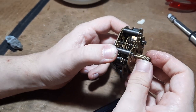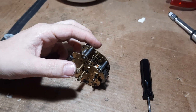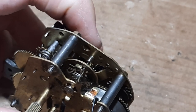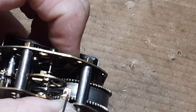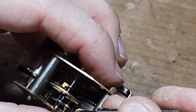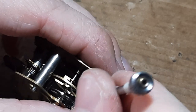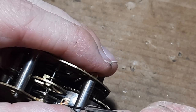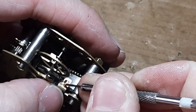So what we're going to have to do is just get all the delicate stuff out of the way first. What I'm going to do is zoom you in - my throat's getting quite dry - I'll disengage the glue here. I'm just going to scrape at it and it'll probably come off in a few big lumps, but it's very important not to kink the actual spring that's inside that glue, because if you do that you may find that your clock may not run ever again.